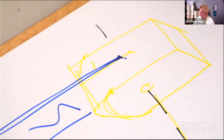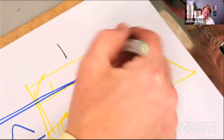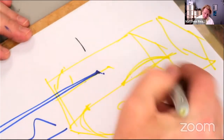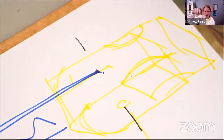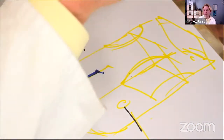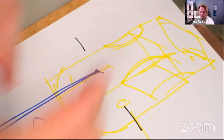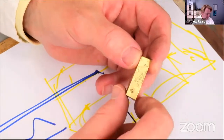One thing you can do with this method is to use a bigger piece of material. And then when you make the top block, cut away the sides like that, which means that when you want to get hold of the pendulum, you can hold it and lift it up, which is quite nice. Or if you're really fancy, you can do all sorts of chamfering on the top and try and make it look old, which I'm not going to do. For that job, you would use something like this material, which is cast yellow brass. You can see I practiced a bit of scraping on there.